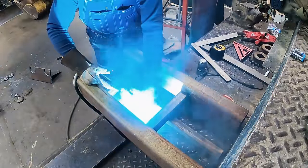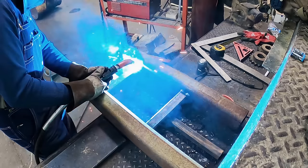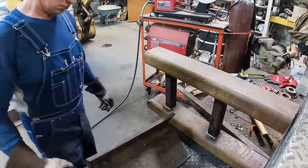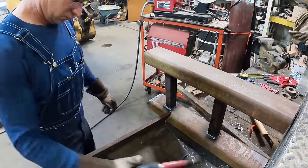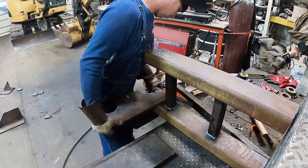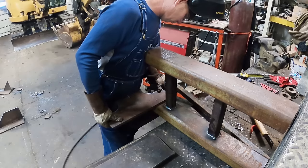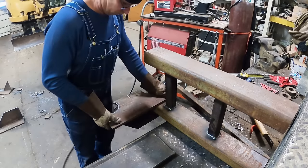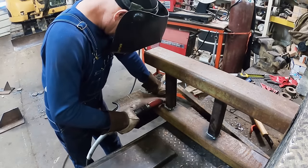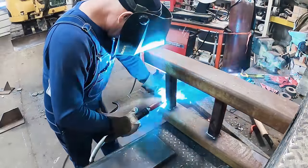But so here's the legs. I'm going to tack all of them together and get that stuff to where they hold steel to steel, so I don't have to worry about anything getting warped or anything funky happening like that. And then now I'm going to put these ears on, and there you see the hose for the pin grabber. So you can kind of see how it's starting to take a little bit of shape. And I'm kind of just eyeballing it.